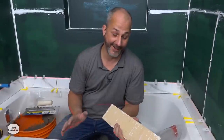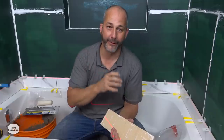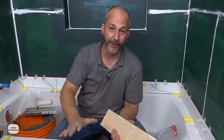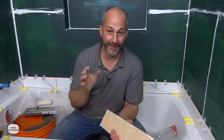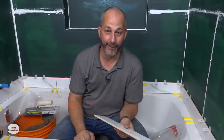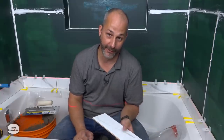Now that is all we can do today. We do not want to start building on this tile because the cement will not hold the weight and it'll all start to slope into the tub, and your lines will go to disaster. Be patient — do yourself a favor, don't run forward thinking you're saving time and energy, because you'll be ripping it all off the wall tomorrow morning.